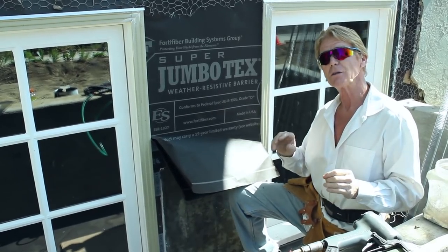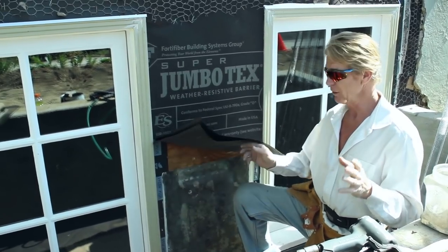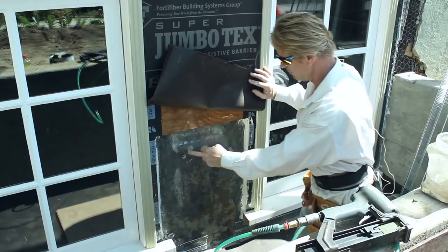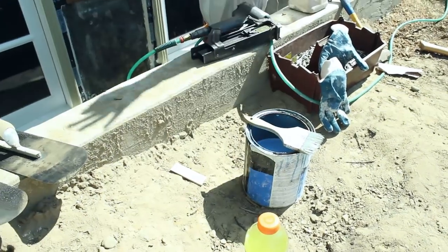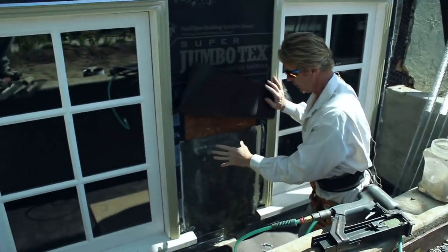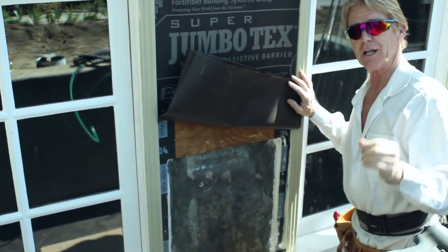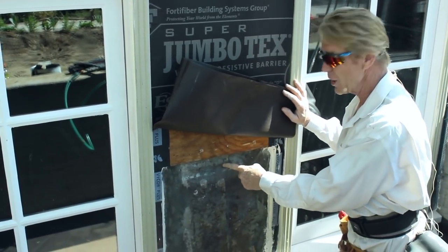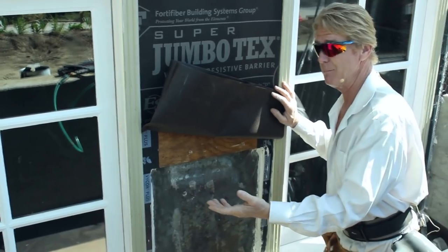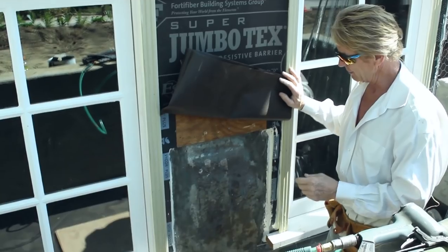What's best? A mechanical bond — naturally — wet stucco to wet concrete already done like this, that's better. If you put wire, sometimes the wire affects adhering forever. If you're going to do wire though, see this blue stuff here? This is Weld Crete. Weld Crete is a bonding agent. It kills the suction sometimes on concrete, but what it does is it allows cementitious finishes to stick over block, concrete, cinder block, and all the rest of those things.